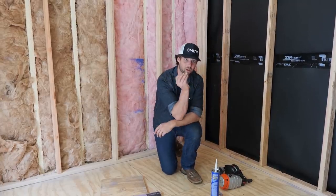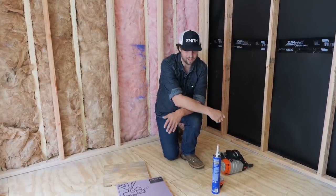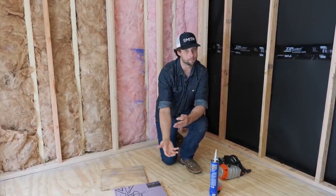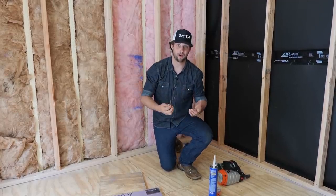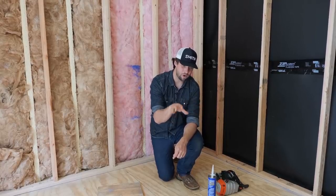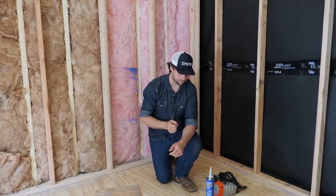The second thing I want to point out is we did not follow the manufacturer's recommendations for installing a subfloor from a nailing pattern standpoint. Normally you'd do something like a 6-inch or 12-inch spacing between fasteners every 16 inches. We didn't do that because I don't want these nails transferring sound energy from my sub-subfloor up through the foam and into my subfloor. These nails are great conductors of sound — just like a bridge on a guitar takes vibration from the string and re-emits it out on the soundboard, the nail would take energy from the bottom and re-emit it out on the top. So we did very few nails around the edges and left most of the field unnailed, because we're trying to decrease the amount of sound that comes through but we don't want it pulling up over time. So we're judicious with our nail placement, and that's it — that's how we did the floor.